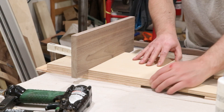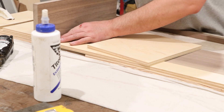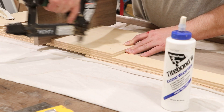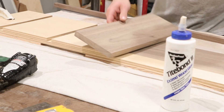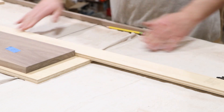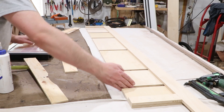This piece is going to act as a stop here so when I swoop my next work piece in it can butt up against this stop, and I know I'm registering off the same spot of the jig so all my dados should line up and all my shelves should line up perfectly. I'm going to use my actual work piece as my spacer so I know 100% I'm cutting the right depth. As I go, I have this clamped down and I'm making sure I can push hard against the last one installed, pushing tight against my work piece so everything lines out nice and square. I'll work my way all the way down, and for the last couple of pieces floating in the air I'll put a stop up at the top to register off there.